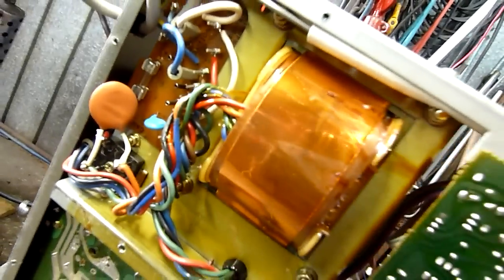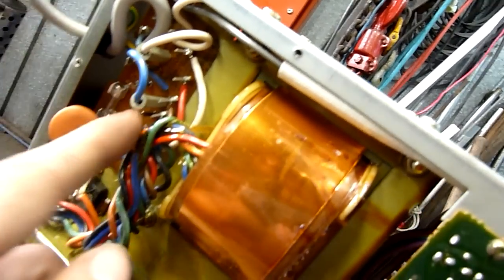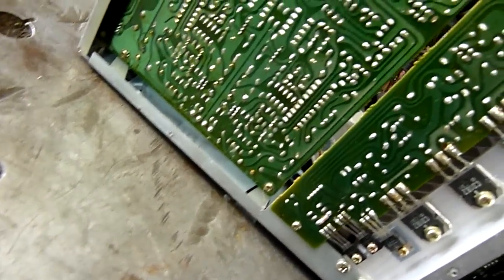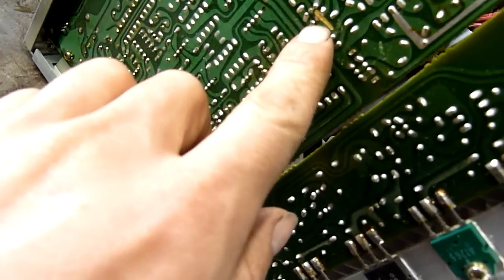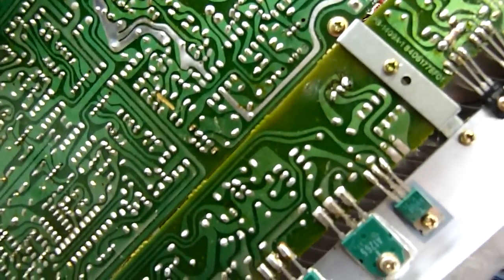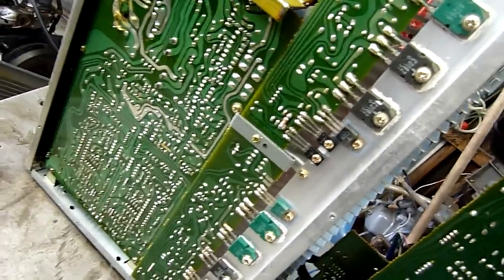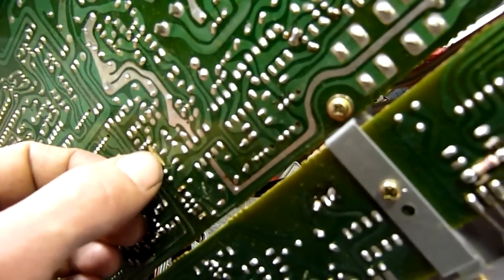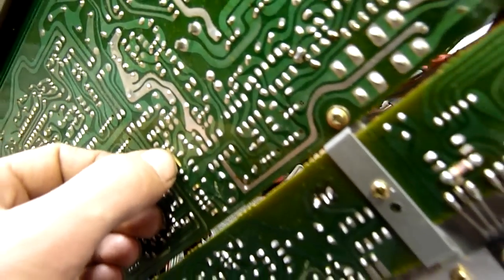I'll do both mains caps and should be right. There's a bridge rectifier there, mains input 240 volts, and voltage selection pins so I can do 220 or 110 volts — you just move the bridges. That's an interesting little modification: they've severed that trace. Looks intentional — looks like they've used a multi-tool or something to cut it. Strange. Probably a factory modification; maybe they revised the PCB after the fact. Hopefully that's just a mod, not actual damage from sitting on something. It's actually been cut in there with a high-speed tool.